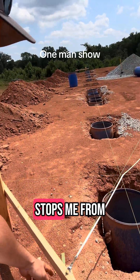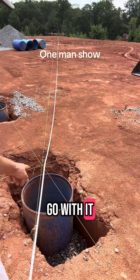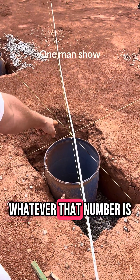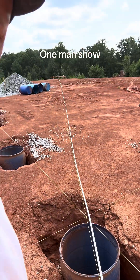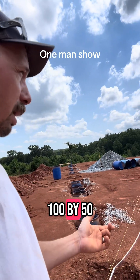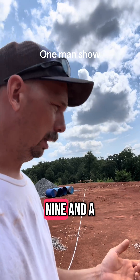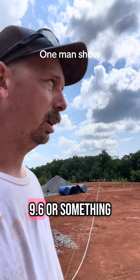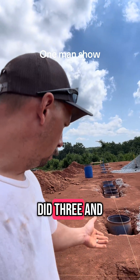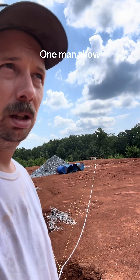Then I thought, what stops me from going to my batter board, putting a screw in, running a string straight across so I know exactly where to go with it, then just hooking my tape and burning three foot six — then just knowing what my diagonal is supposed to be and being able to check it. For this 100 by 50 on the outside of the string, it should be 111 feet 9.5 inches — the number might be 9.6 or so.